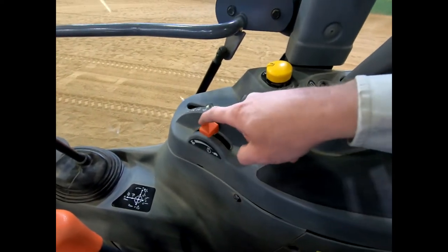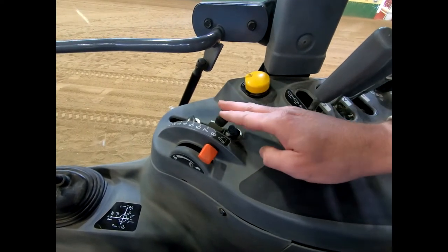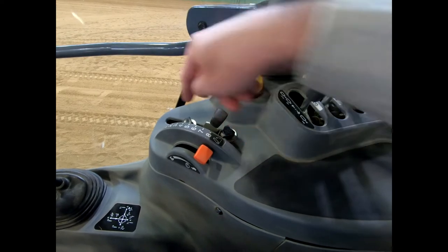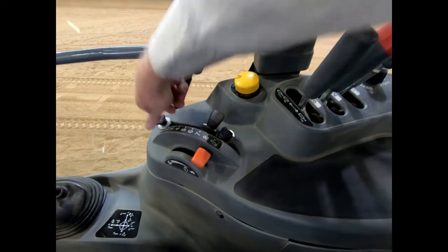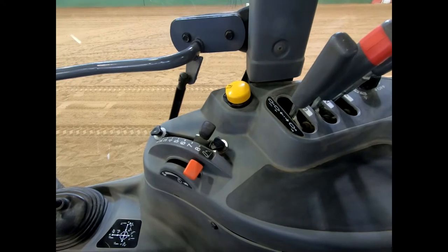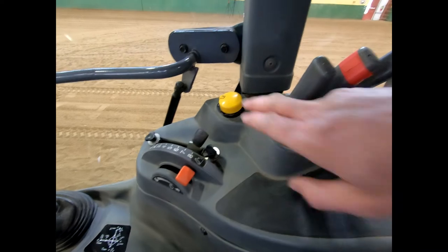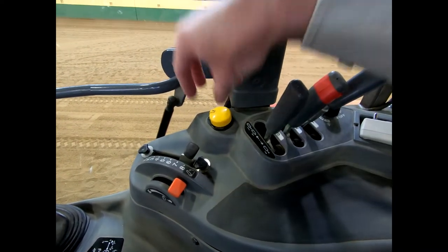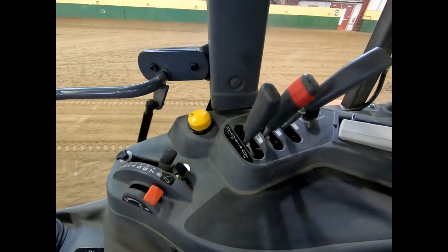If we walk around a few other things: there's the throttle somewhere over here matching that foot throttle. This right here is the adjustment for the three-point hitch — we've got these stops engaged right now, but we could easily loosen one, push it forward, and this is going to raise and lower the three-point hitch side arms in the back. The yellow button, if you had to guess, would be your PTO shaft. Most of these you push in and turn to engage it, then you can just hit it to disengage it. You're usually going to find a yellow button on the right-hand side that is PTO.